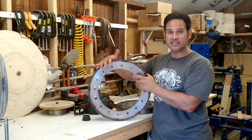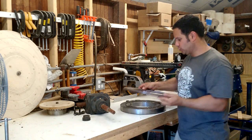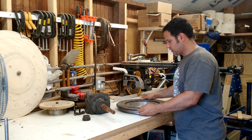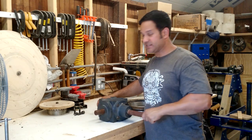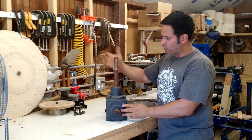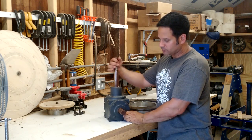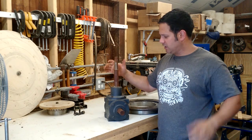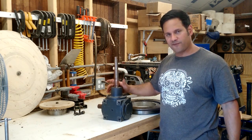The idea is that this plate and ring gear fit onto this slewing bearing. This gearbox, you see right here, is a one-to-one gearbox — one revolution of this shaft gives you one revolution of this shaft. For my purposes, that's fine. I think this is rated for about ¾ of a horsepower, so it'll be fine.